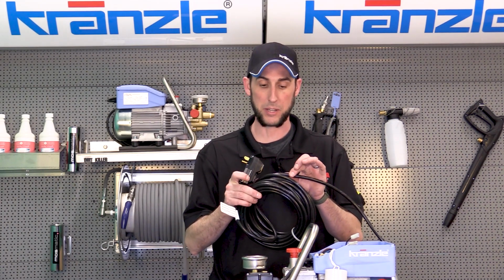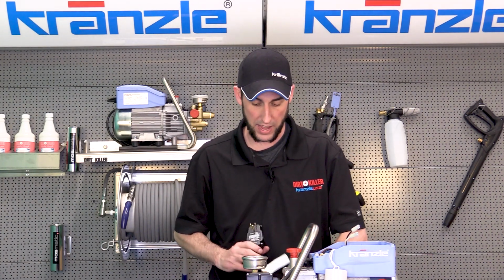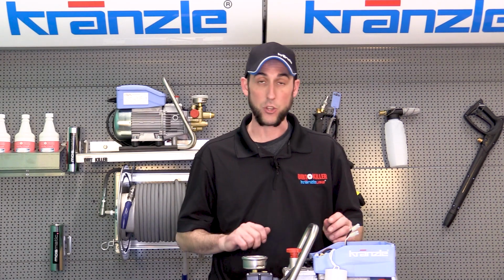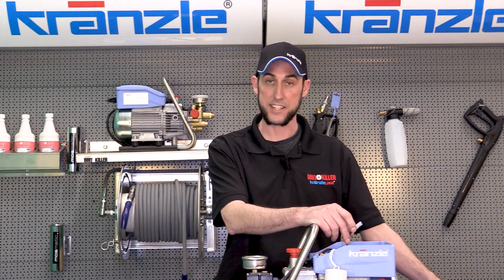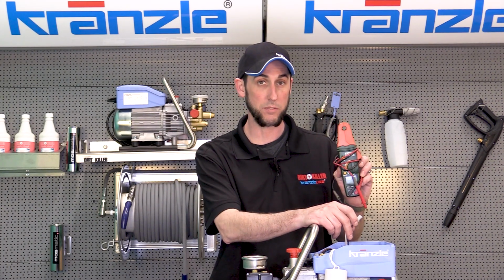At that point, if it again trips, then your cause for the GFI to trip is somewhere in the wire. It's probably got some broken wires inside. Unfortunately, at that point, you're going to have to replace it, and you can refer to the GFI replacement video for that.